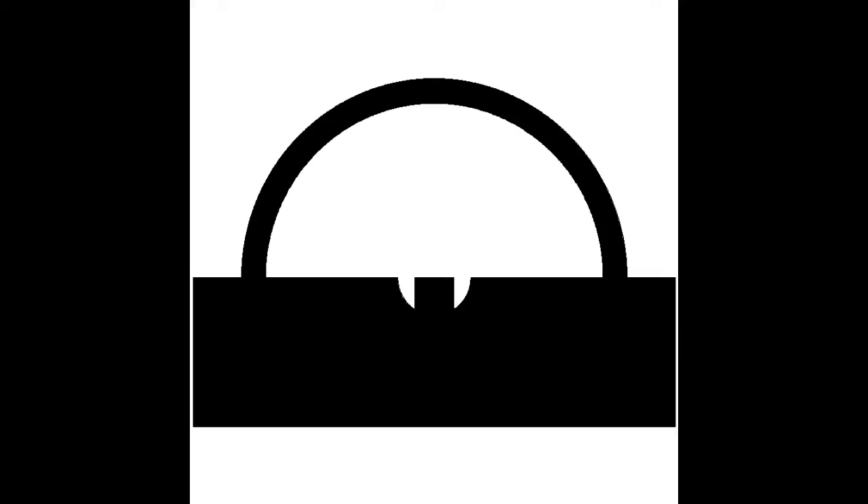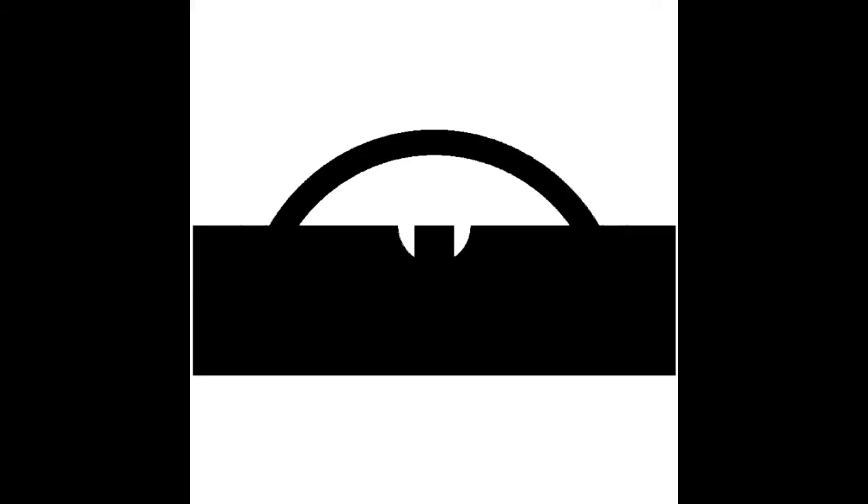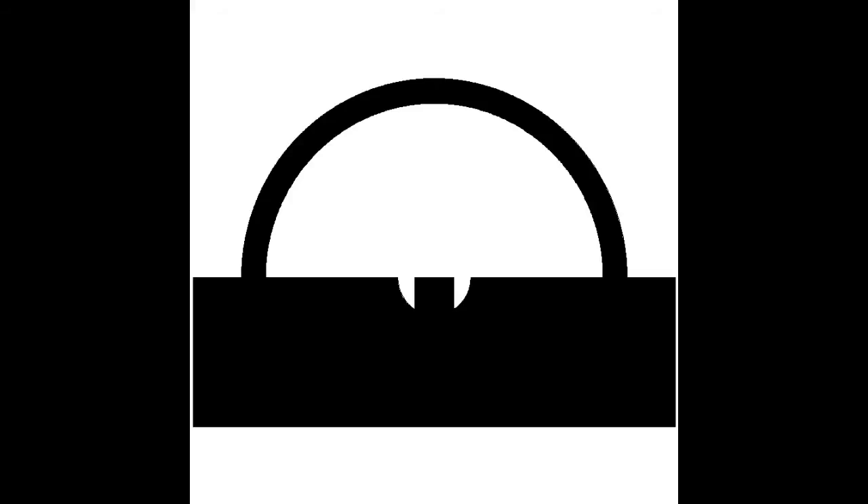Another thing that machining the whole globe from scratch allowed us to do was to make the globe itself sit higher off the barrel. Here's an ideal sight picture. If your Mosin shoots high, you could find a way to raise the post in the stock sight globe, but if you have to raise it very much, it starts to crowd the top of the globe and your sight picture starts to look like this, which is not ideal. By making the whole globe sit taller, our sight lets you keep the post nearer to the center where it belongs. So if your Mosin shoots up to 8 inches high, order the Type A. If it shoots more than 8 inches high, order the Type B. That will keep your sight post as close as possible to the center of the globe.